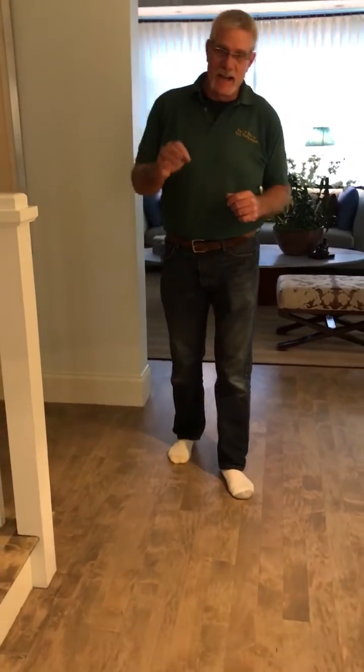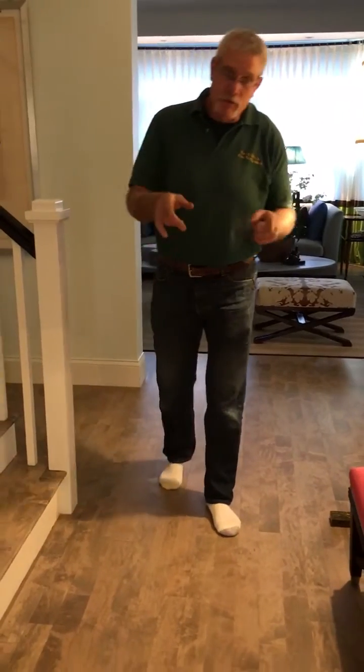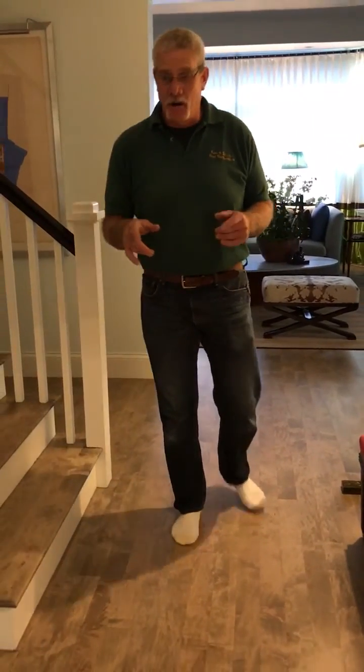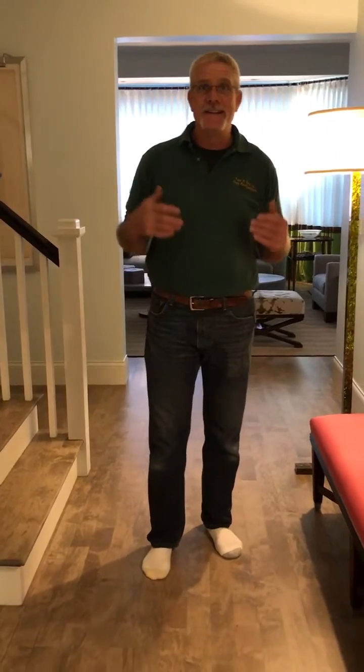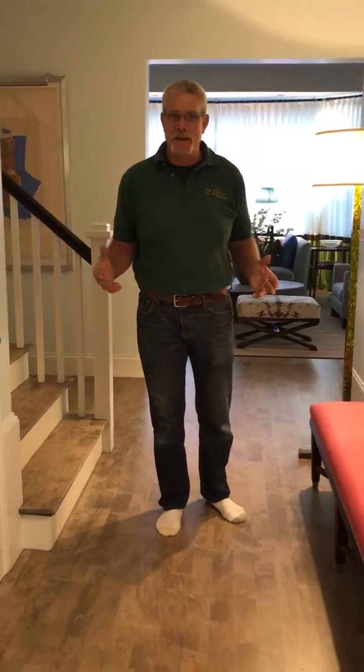It's a great, nice, just gray haze on the floor. You have to note that birch, beech, and maple are all kind of a blotchy wood. The grain takes a stain very blotchy looking, and it's something that you just have to be ready for.